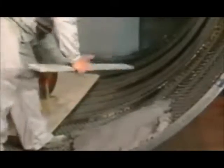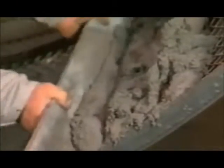On horizontal surfaces, larger amounts of the material can be applied at a time. In all circumstances, it is important that the material be worked well in under the reinforcing net. To ensure a wear lining of even thickness and to facilitate its application, steel guide rails with the precise thickness of the intended layer of Densit can be mounted. These may later be removed. Here they've been allowed to remain in place, as they also function as stiffening rings.